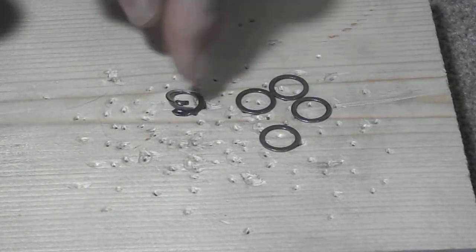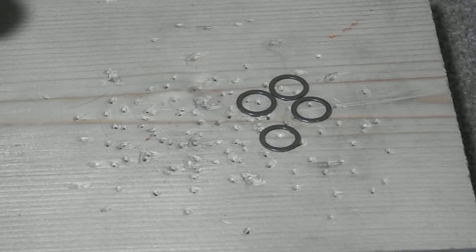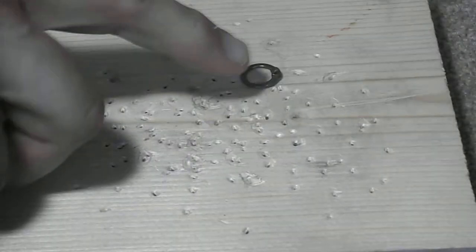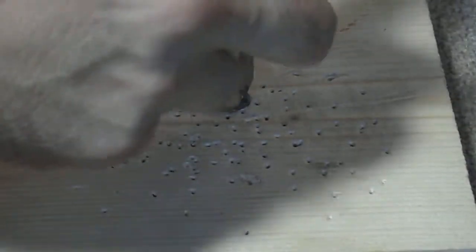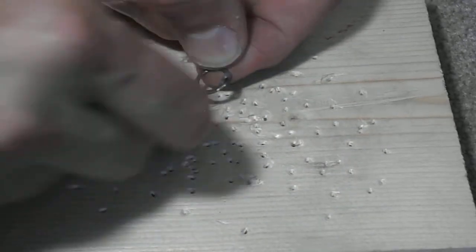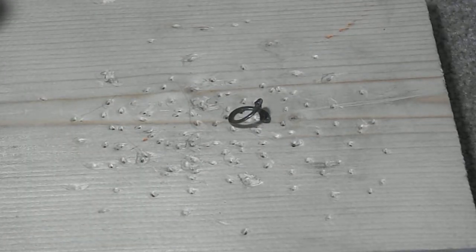cut on each end and they're smashed and have a little indentation. But with these, they are not driven all the way through. So that's what the awl is for. Take the awl, put it in the hole, give it a little tap. So it's making the hole all the way through so it's easier for the wedge to sit in it. And open up a little bit, pick up four links since this is 4-in-1 mail.